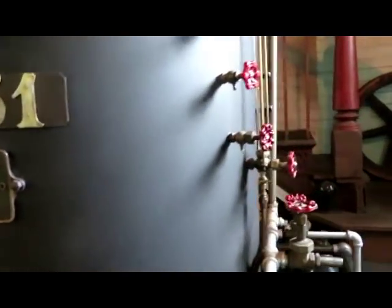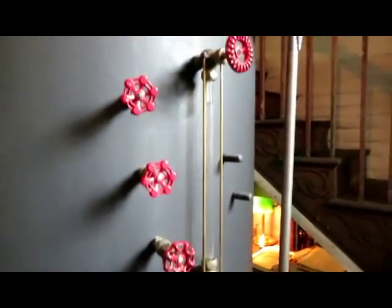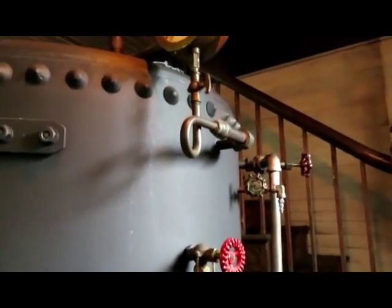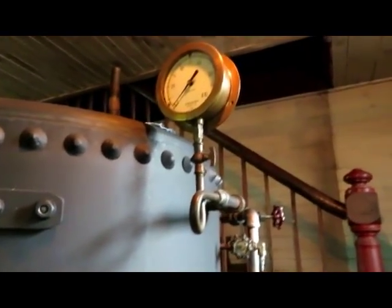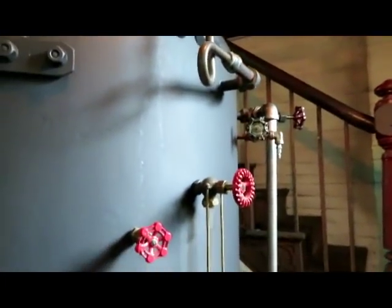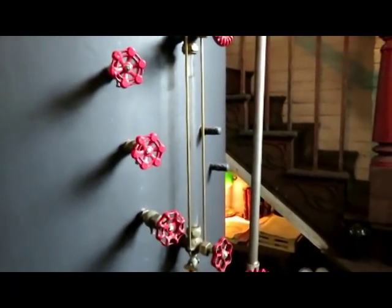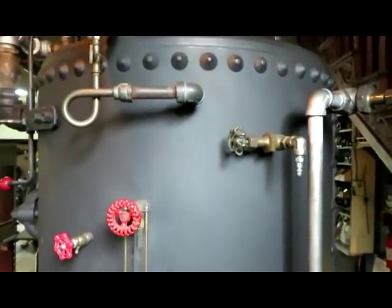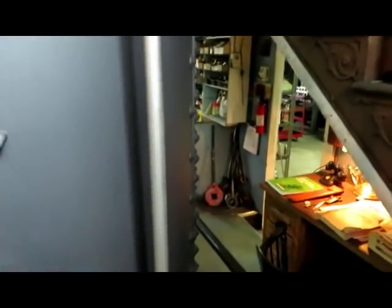Another thing is that when the boiler is steamed, the oxygen comes out of it, and it's the oxygen that does most of the damage. So if you're steaming the boiler regularly, like every day or a couple times a week, it's fine. The oxygen doesn't have time to get back into the boiler. But if it's going to set for a week or more, the boiler really needs to be drained and dried to keep any corrosion from happening. Well, that's not real convenient to do.